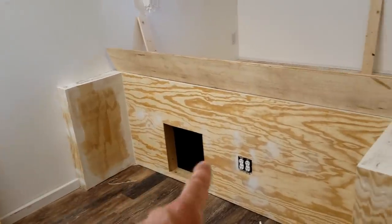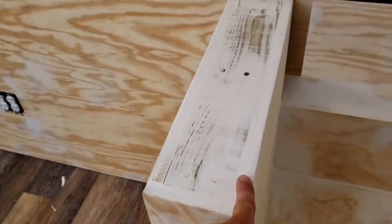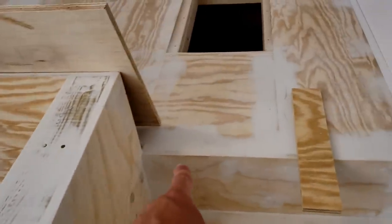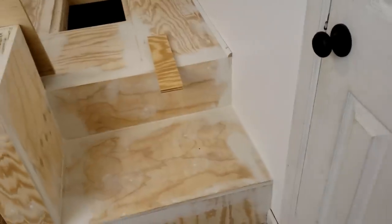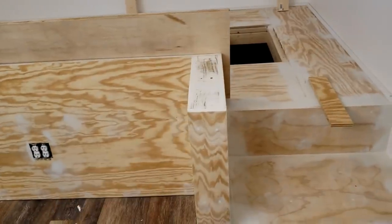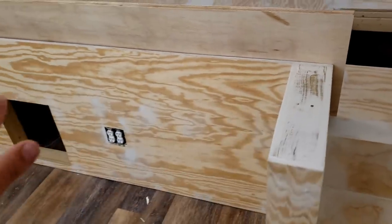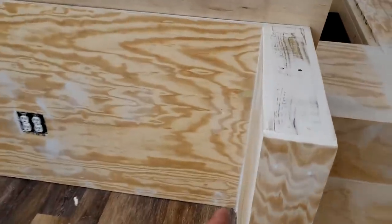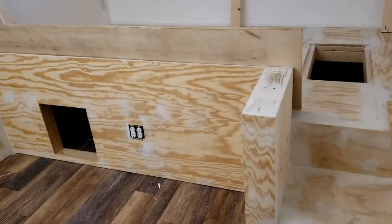The desk has all the plywood on. We've done all the mudding — covered up all the little screw holes and any imperfections where the plywood came together, the corners of the stairs, those little gaps. I did that with drywall mud instead of putting trim there, since that's mostly plywood to plywood. I may end up putting trim there if it cracks. We've got our desk piece — the plywood for the top — cut and ready. We've got supports going in a couple inches lower on the inside, with another shelf underneath the desk. Let's dig in and get to work.